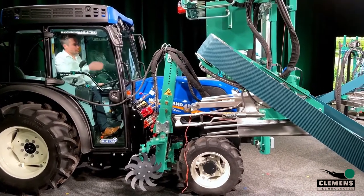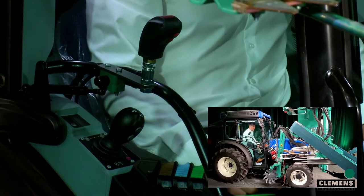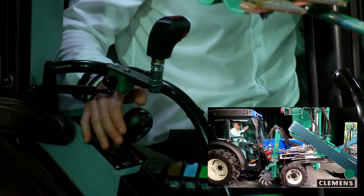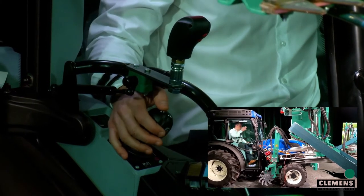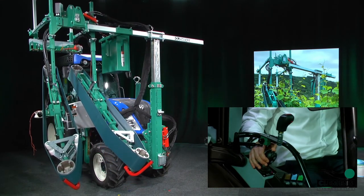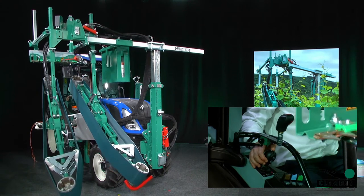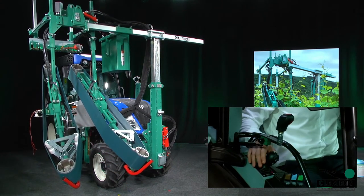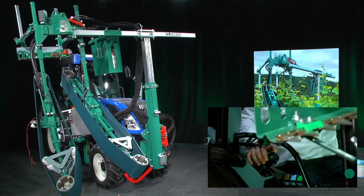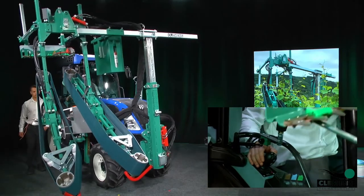We will make the movements of the mast and the angle of the support unit of the shootbinder with the hydraulic movements using this joystick from the tractor. Going the joystick forward, it goes down; pulling it toward me, the mast will go up. Pushing the joystick to the right-hand side, the mast will move to the right-hand side. Pushing the joystick to the left-hand side, the mast will go to the left.